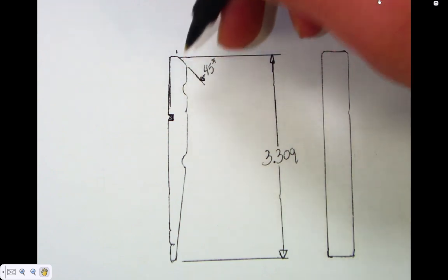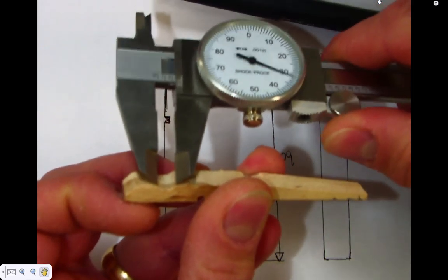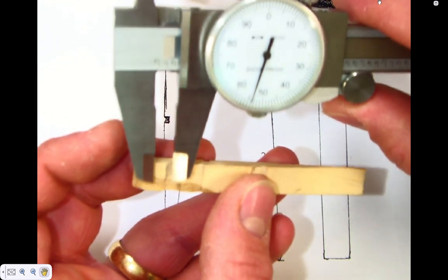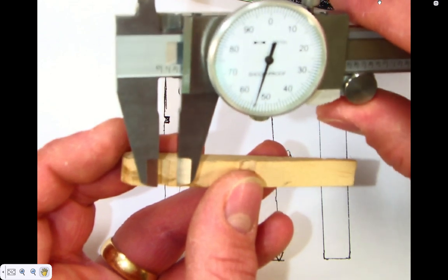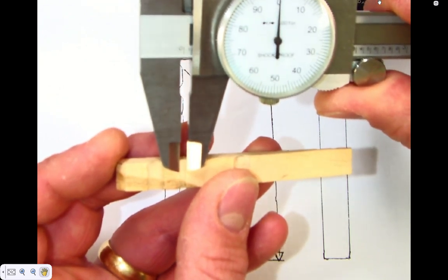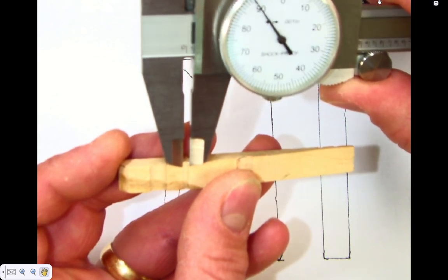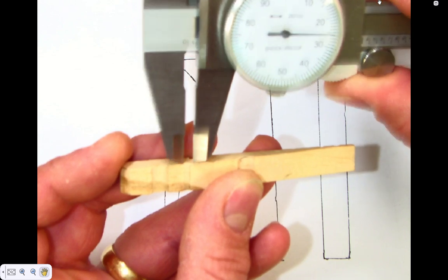So when you measure these holes with your caliper and you get an approximate size, for example, let's say the spacing of that hole measures about 0.254. Well, they didn't use a 0.254 size drill bit to drill that, they used a 0.25, so a quarter inch drill bit. It's the same thing here. You can get an approximate measurement for this, and it's coming in at 0.09. I'm not quite sure what fractional measurement that would be, but it would be somewhere between 1/16 of an inch and 1/8 of an inch. So we could probably just say it's 1/8 of an inch, so 0.125, and so on.